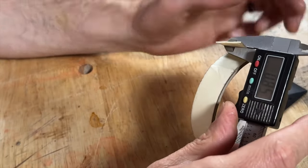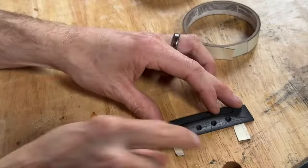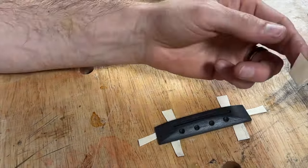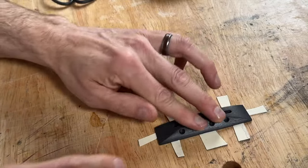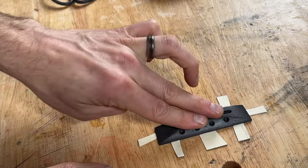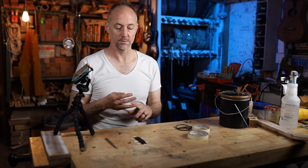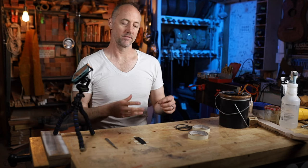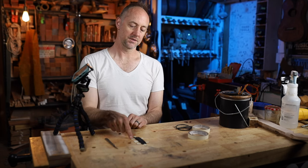It's 0.8 of a mil or 33 thou. Say I wanted to clamp something here — I cut the tape and use the very flat cut side to butt up against the bridge, placing tabs all around: two on one side, two on the other, and one on each end. I can just clamp it right in place really quickly. Just make sure you butt these right up against it and now it's not moving at all. It's a really excellent and fail-safe way to use hide glue on a bridge so it doesn't gel before you get clamps on through the sound hole.